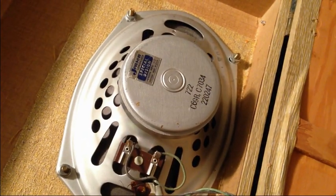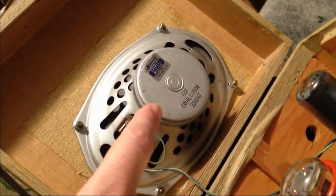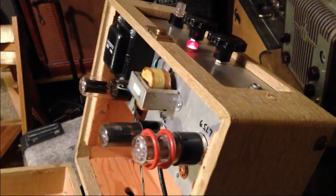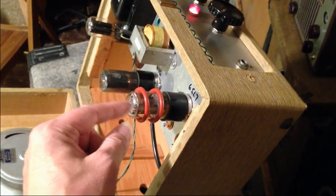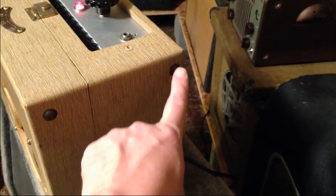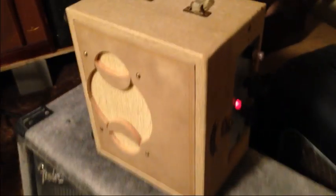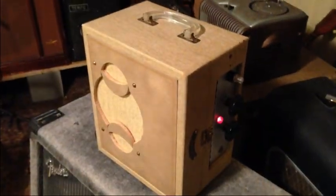The speaker I ended up using is a C69R from 1962 — I think this came out of some kind of Hammond tone cab. The only downfall is that since this is such a tight enclosed cabinet, you do sometimes get a little bit of microphonics if you have the wrong 6SL7. I had to go through a couple of 6SL7s in my stash to find one that's low microphonics. She's got little original brass feet on the bottom for the record player, and the original Lucite handle is on the other side. You could also open it up and have an open-back tone — we'll test that out momentarily.